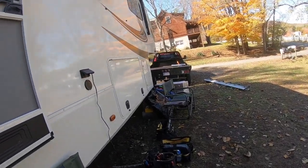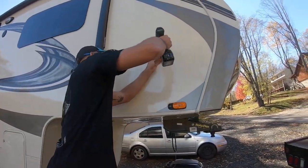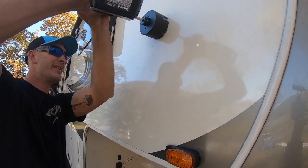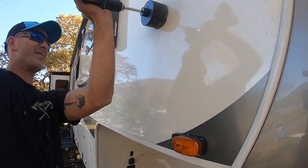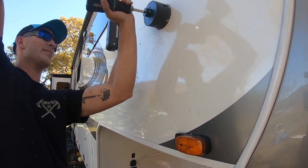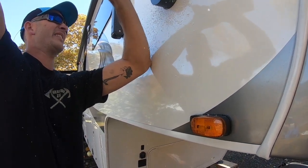I'll use this pilot hole to start my drilling from the outside in. You always want to drill fiberglass towards what you're working on. If we tried to drill from the inside out, we would blow out the side of the wall and you'd have a really bad mess. As we start to drill the four and a quarter inch hole saw, start slowly. Do not just go wide open because it will rip across the fiberglass. You need to make a channel. Start slow with the drill and get about a quarter inch deep. Just slowly keep drilling in little sections until you really start to feel it grabbing and biting, then you can push through. Remember, let the drill bit do all the work — these things will break your wrist, so hold on tight.